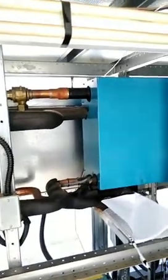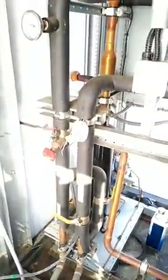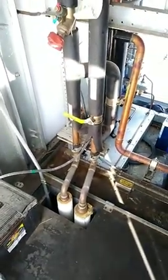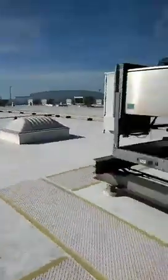I also need to order a desuperheater. You've got the hot water coming in and you're getting kind of free heat — it preheats the water and circulates it to warm it up, so there's less load on the gas-fired hot water heater. But that's valved off because it's leaking all over. And that is factored into the condensing — it's a pretty small condenser, it's a four-fan — so that could be part of the problem too.